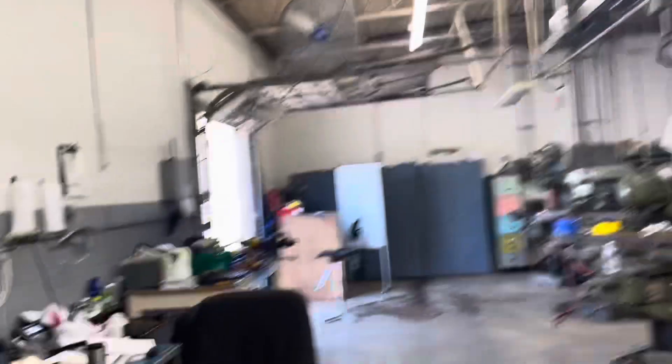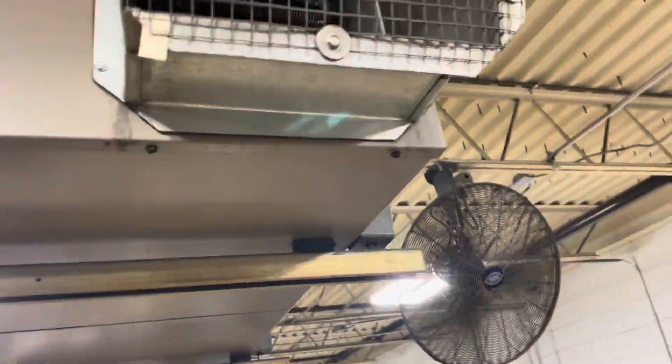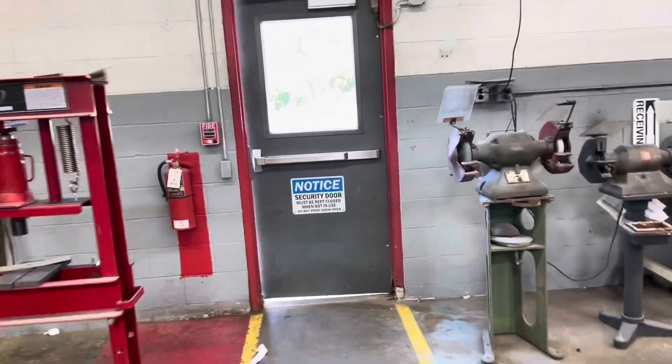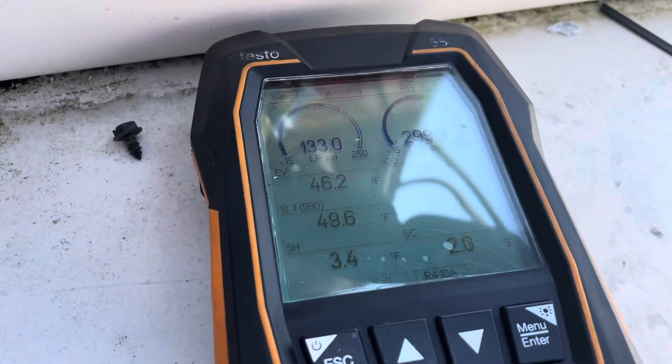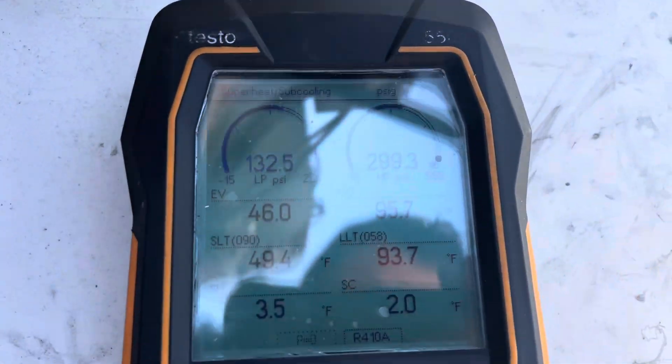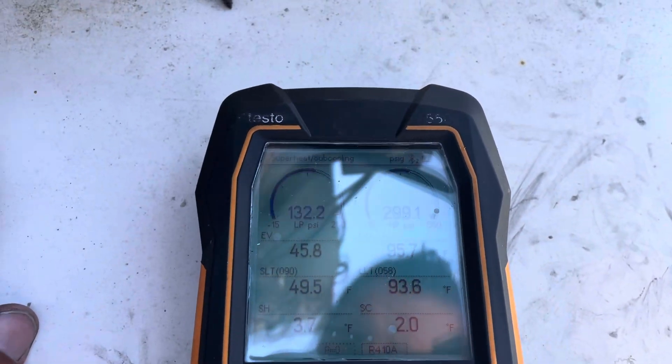All right, let me go close this door. I got the door shut so we can keep the air conditioning in. The field test is super cold. Yes, sir. Pretty satisfying fixing two air conditioners that do the same space. If you guys are interested in getting a HIK Micro B20 for yourself, I'm going to put a link down in the description. It's a little more spendy than the TopDon TC002, but it's a pretty good camera — I'll put a link down in the description. All right, this is what we got here. The superheat is a little low, so is the subcooling, but we have a pretty good temp split. I don't think I'm going to mess with this one anymore — we'll see how it settles out.